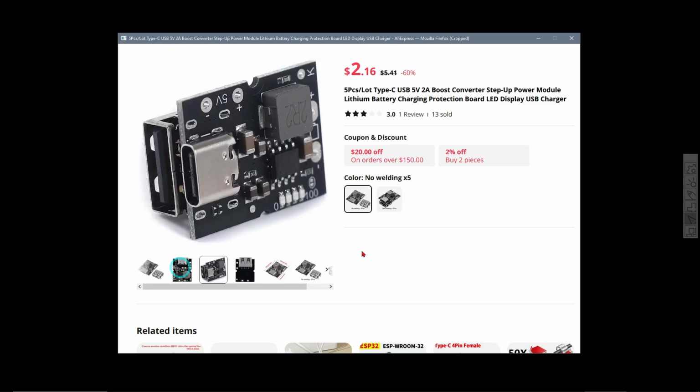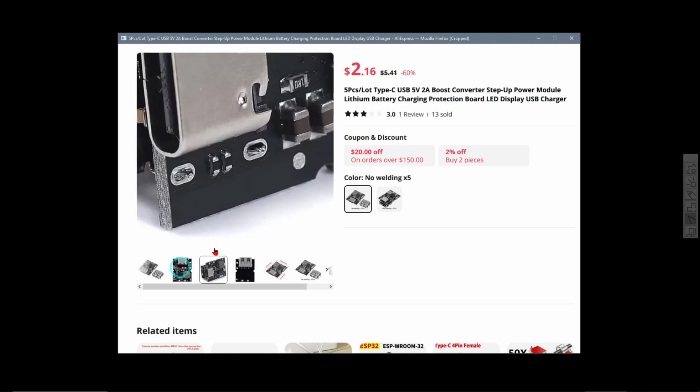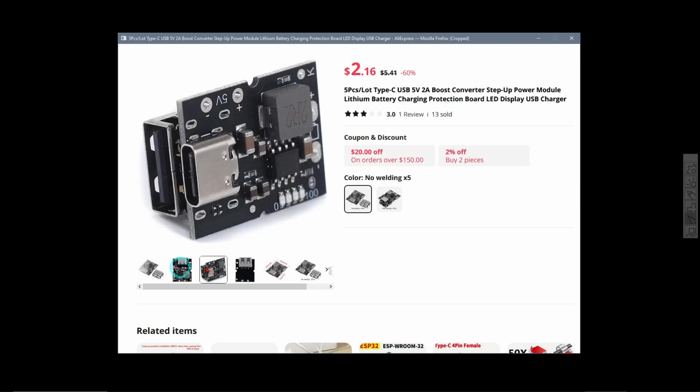And it's supposed to have an automatic start mechanism. Like if you plug something into that USB socket, for instance, which you'll see when we try it out, 8 out of 10 times, depending on what you're plugging into it, it will start. And if you're drawing more than like 50 milliamps or something like that, it will keep running, and then that's fine.